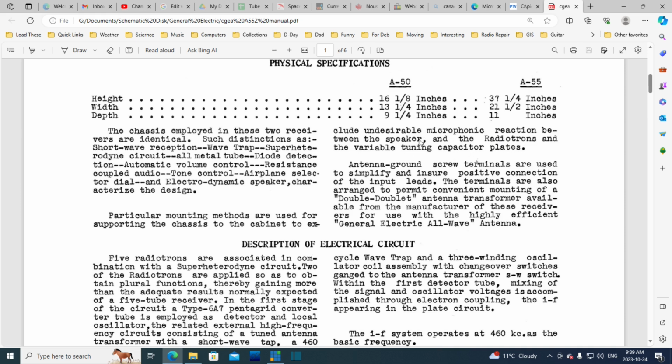Interesting. Also, the tubes themselves can be vibrated. The elements can vibrate and move relative to each other. So the heater cathode can be vibrating one way, and the grid is just kind of a loose bag of wires in there. It's going to vibrate. So feedback can occur that way, almost like a mechanical feedback.